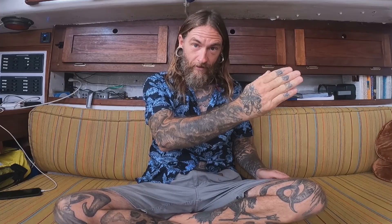You might be close to shore or you might be far offshore. Either way, if you can make way — whether with sail or with motor — then you're going to be able to steer with this drogue in a limited capacity, but you will be able to get yourself close enough in that you can get help. The easiest way for me to describe how a drogue works: imagine someone canoeing or in a kayak and they put their paddle down in the water, turn it sideways, and it creates resistance — then the front of the canoe or kayak turns in that direction. That's exactly what the drogue does on a much larger scale.